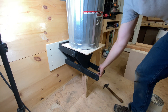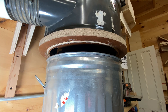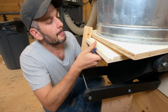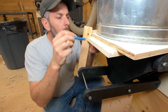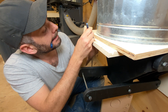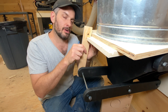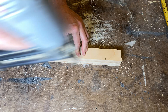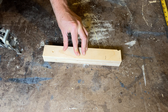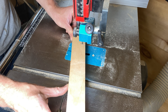That's my quick test and it seems to work pretty well. Now I just need to work on the locking mechanism so it stays up when I lift it. I've got this piece that attaches to the underside of the platform with a little back bevel, and I'll mark the position so I can make a piece that attaches to the front bar and hooks over the top. Since I'm making two of these I'll brad nail some plywood pieces together about the right shape, and those brad nails will just get cut away as I shape it on the bandsaw.